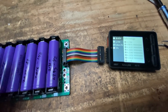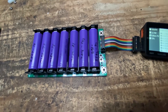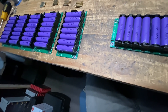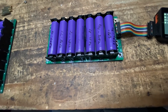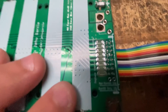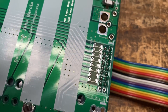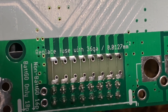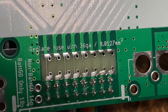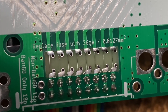That's why I like to test them. So how do you fix that? Well, you just don't use this board — that's the easiest way. Hopefully you got several extra boards. If your project needs 10, maybe you got 11. If you didn't, then you could actually fix this. It's kind of a tedious job, but you could do it. It requires — you can replace the fuse trace with 36 gauge wire, or 0.0127 millimeter square. You can search for that if you want to be super precise, get a 36 gauge wire and do it.